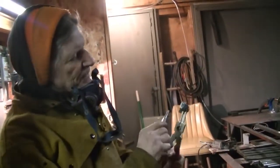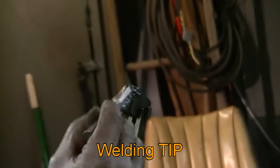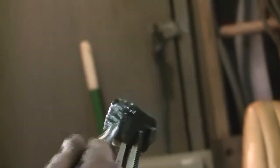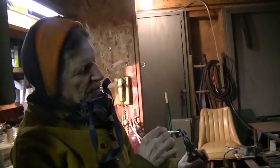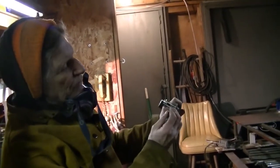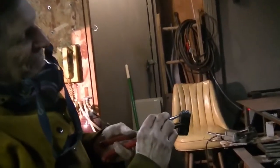A little tip on welding: when I'm welding the bottom part of this hammer, instead of welding with the pieces I'm welding across the pieces. It's a whole lot easier to see your edges and the weld seems to come out a whole lot better going across rather than with the pieces. When I do the sides, I'll probably use a series of circles or E's — backward E's — on both sides, because that's not as critical.